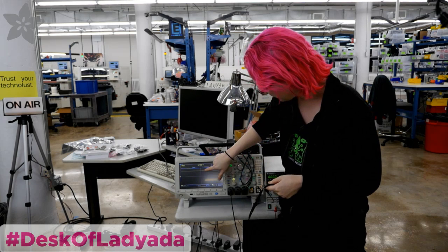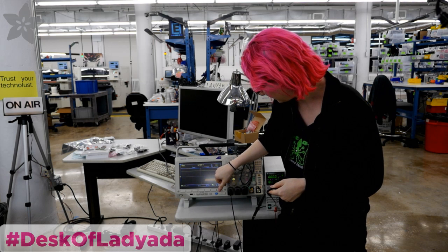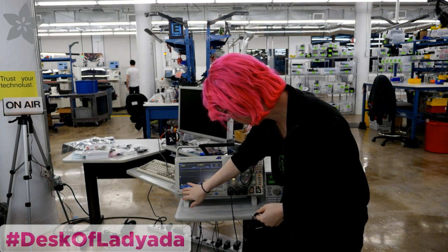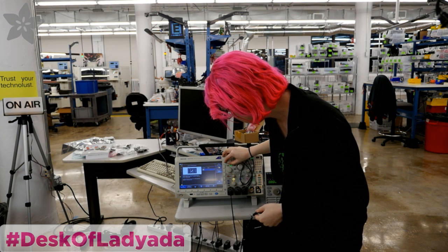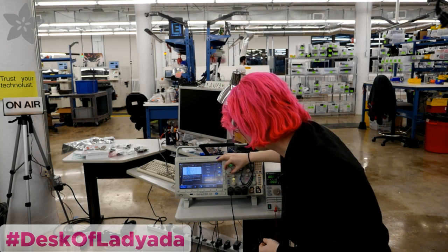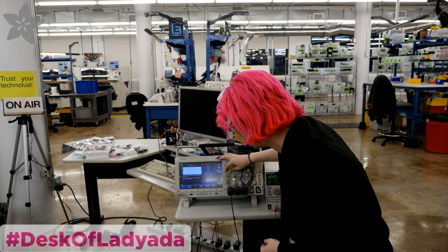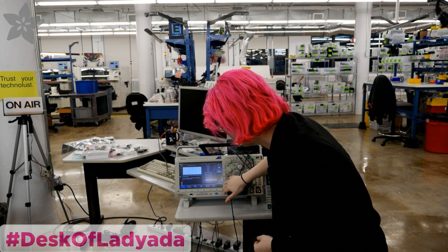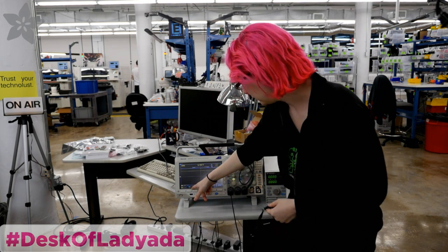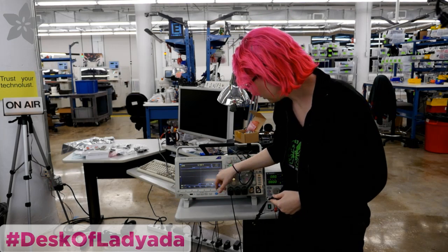You've got your scope here, and just to start, you want to measure your open circuit voltage. So clip that on, and it says right here a nice 5.15 volts, nice and flat. This is kind of nice because it has this big display. It'll also tell me the peak to peak — I think I can measure that. So now I've got this peak to peak of about 300 millivolts peak to peak, which is actually really not so bad.